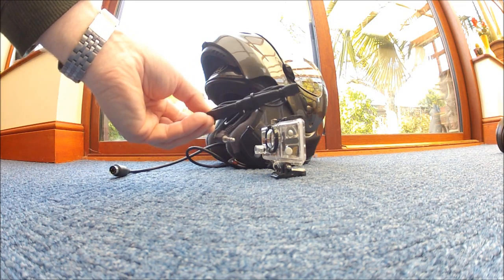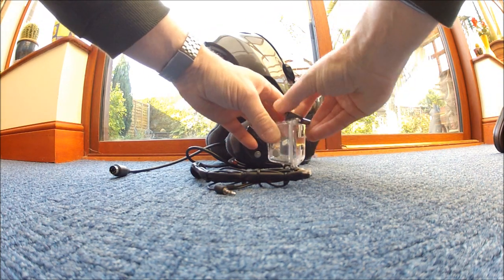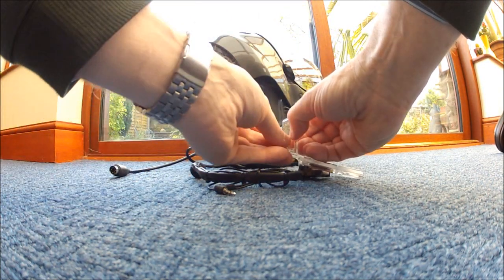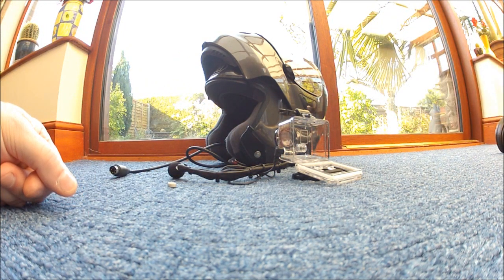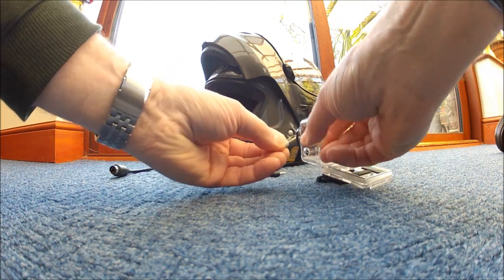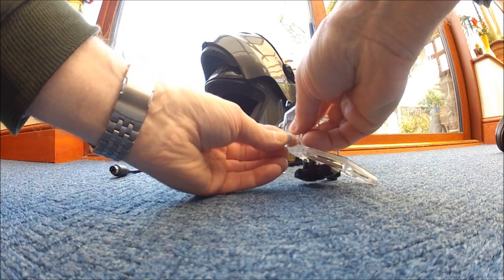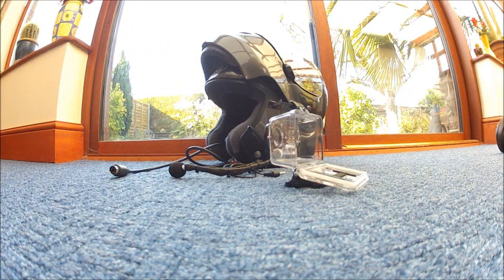It works perfectly. What we've done is drilled a hole in the housing where the GoPro fits, where the microphone jack is. If you do drill it out so it fits exactly, it might take a while — don't rush it, otherwise you're gonna cock it up. Start off with a very small drill, get bigger and bigger, use a very small needle file, and make sure you get a nice tight fit. A little bit of silicone probably makes it waterproof again, but I bought another housing off eBay anyway — they're quite cheap — and it just squashes in there.